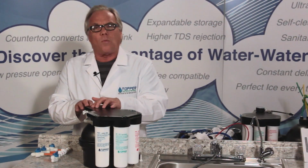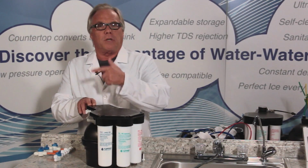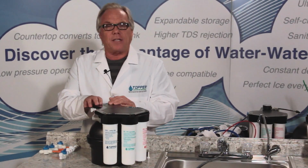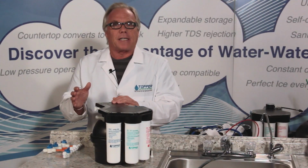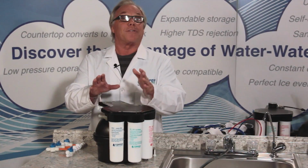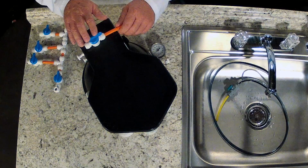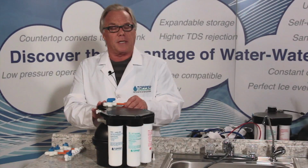First off, we've gone with the 1/4 inch and the 3/8 inch for two reasons. One, the 1/4 inch is usually your shorter run, possibly to your kitchen faucet, which is the dedicated faucet at your kitchen sink. And the 3/8 inch line for servicing long distances, anything over 6 feet, let's say. We like to have this machine hooked up to something that's 3/8 in diameter, that is. So, what is required of the machine is an independent shutoff valve beyond the primary faucet. So the primary faucet would be at the kitchen sink, let's say, really close to the machine.